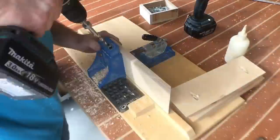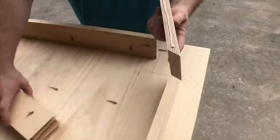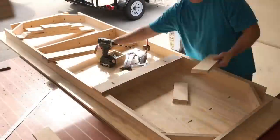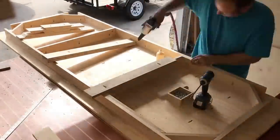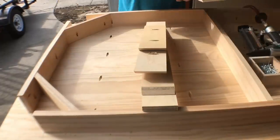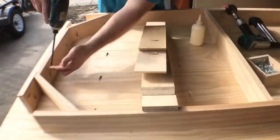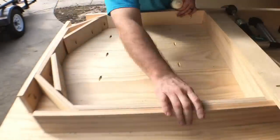I've gone ahead and cut every piece I needed. Use a little wood glue and you're in business. This technique of layering Baltic birch behind these pine boards is really going to give it a lot of rigidity and keep any twists and turns out of the table. This technique I got from a guy named Jimmy DiResta — he put out a farm table video, I'll link it in the description below.